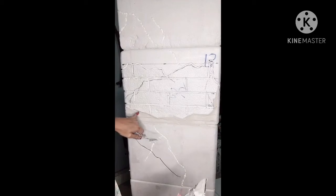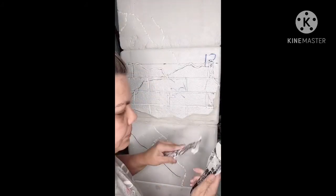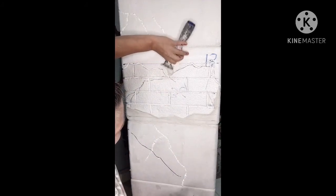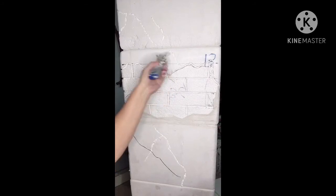And it changes it for the natural appearance as well. Don't worry about your overlapping lines because we're going to sand those out. You just want kind of like a rim that goes around — that's your goal. If it overlaps or shows imperfections within, it doesn't matter because we're going to get those out. For smaller areas like this, you're going to take a little bit on your 5-in-1 on the tip — do the same concept. If it falls, that's fine. Pick it up and readjust.